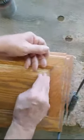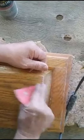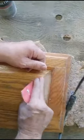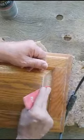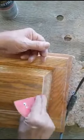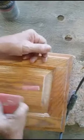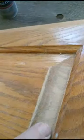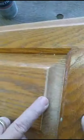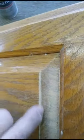So when they sanded these doors in the beginning, they did a light sand, all right? But they left the wood grain coarse. And this should reveal enough of the wood grain for you to see better what it is I'm referring to. Okay, unpalm sanded. This is hand sanded. And you can see, with the right angle, you can see the pores and they're open. I'm not sure what's working the best because I can't see. My screen's not the clearest right now, so I'm hoping you can see the pores, how open they are.